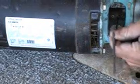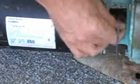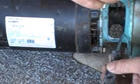Okay, the next thing to be done is to set the impeller. The impeller and the shaft extension are in here. You can see we've got our set screws here. We're going to put in our Allen wrench. This is the key to this thing. We want this impeller up against this volute as far forward as we can get without touching. Right now it's forward all the way so much that it's touching. So what we want to do is back it off a little bit. I just come in with a screwdriver, and you can see with the screwdriver, I'll leave my set screw wrench up here up top. You can see that I can move this shaft back and forth. Okay?